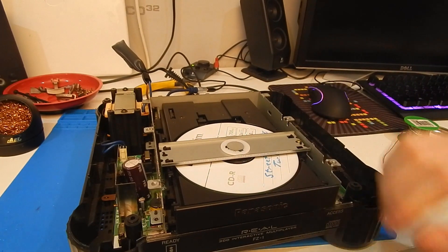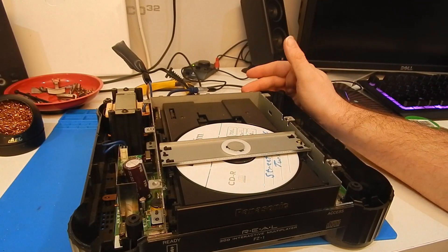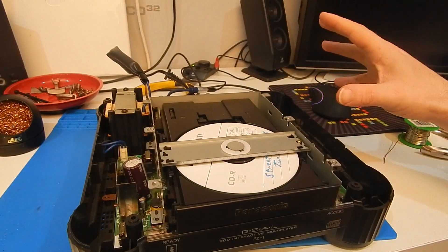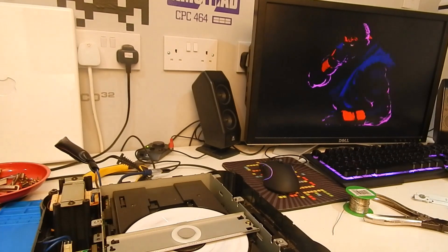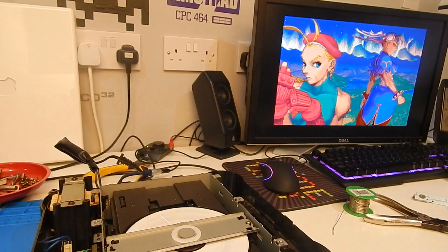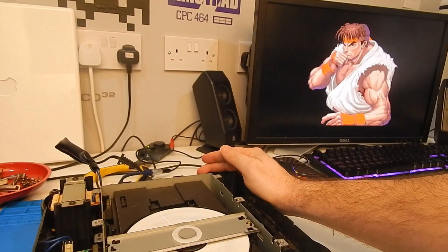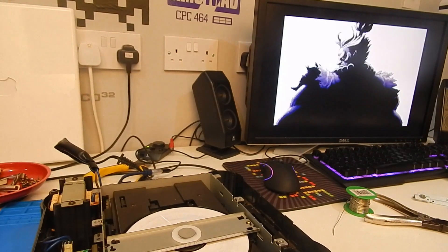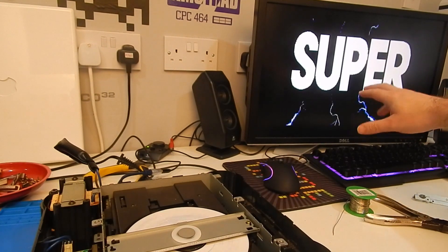All right, so we are back together again — loosely for now, just a test. We have the switch; let's put it to interlace mode. The switch is pointing towards the power supply, meaning 5 volts is going through to the BT chip, so this is as you were. Let's power on. Everything seems to be working fine with the switch at interlace mode. Let's flick it across to progressive 240p. It is very hard to tell any difference on a moving image like this, especially through the camera.